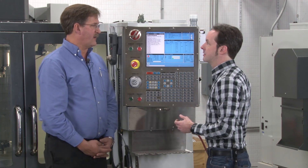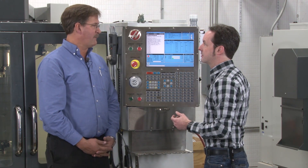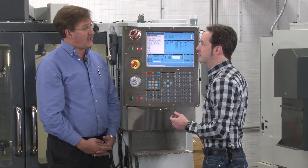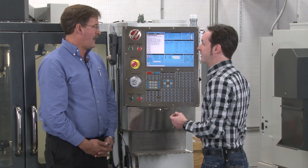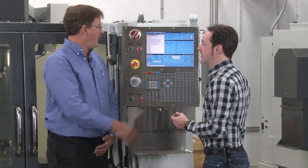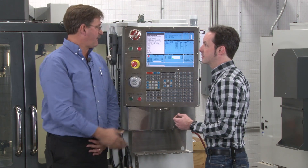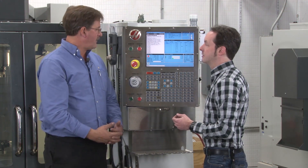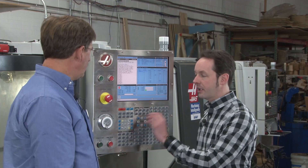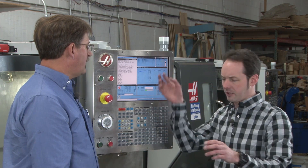If you're running a warm-up cycle and it's a beautiful summer day and it's 80 degrees, it doesn't need the warm-up time. If you come in on a Monday morning and it's 15 degrees outside, it's only 40 degrees in the shop. So in the summertime you wouldn't give it as long a warm-up. It's halfway through the warm-up cycle — say I'm done with this now — and my first tool up isn't going to run at full RPM, and that'll be fine. I've seen the guys in the shop use it a lot when they're doing setup and they'll just reset out of that.